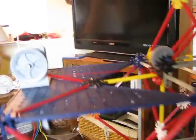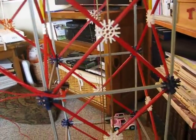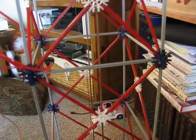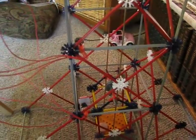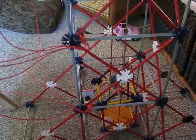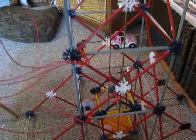I was very happy with the way the project turned out. My first program that I wrote had an issue where the car would go up, and as soon as it got to where it was supposed to be, it would immediately come back down. I figured out that I had written some things wrong — I had if-statements following each other, so as soon as it got done with one if-statement being true, it would go right to the next one and send the car back to where I'd sent it from. But I fixed that.